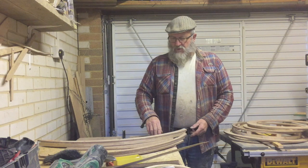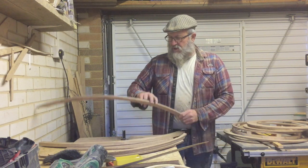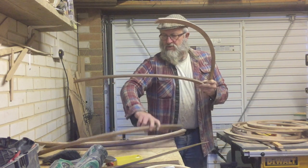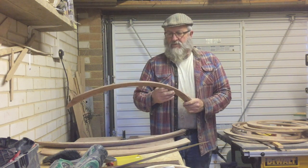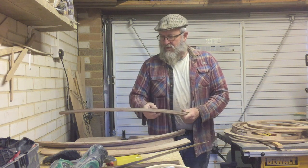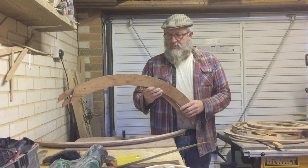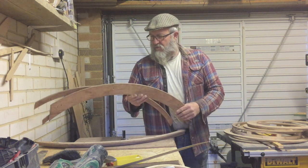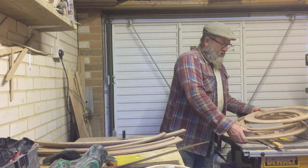That's really going to bring me to the end of the curved work. Just to summarise: for the arch windows — one, two, three, four templates just to do the various different arches. The thing is, if you don't get the template right, however good it is, it depends on how good the piece of timber comes out that you're working. You really need to be very precise. I make these templates out of marine plywood because it holds up a lot better.